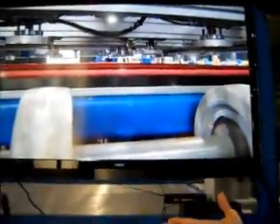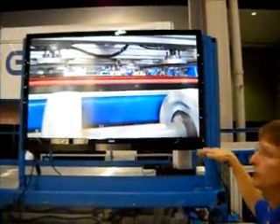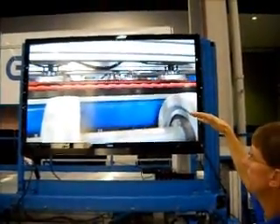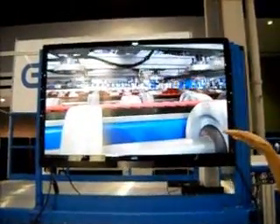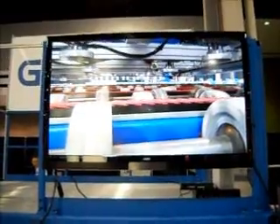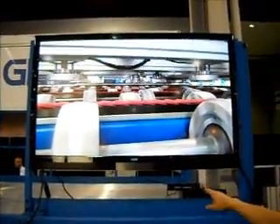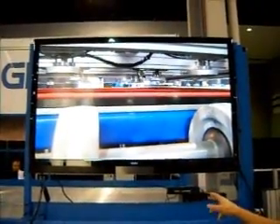What's happening is the center light is going to travel in through the Bernoulli pass, lift up, and suspend in mid-air. The outer light is going to slide underneath it. The machine is going to precision register the edges. And behind this process, there's another piece of glass for the spacer.